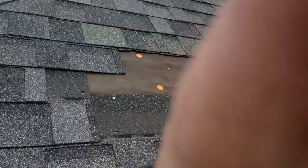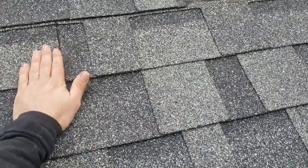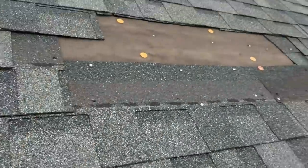If you do need to troubleshoot your roof, you probably just want to start with finding where the leak is. Obviously you know that there's a leak — a yellow spot on the ceiling is going to be a leak that's already dried from a couple days ago, while a wet spot on the ceiling is a current leak. For the most part, nine times out of ten it's going to be a pipe or a chimney — something out in the detail area. Shingles aren't supposed to leak out in the field unless you've got something like nails near seams, which is a really tough leak to find. One of the best ways to find it is to go up in your attic, take a look around — you find wet insulation, water droplets on the underside of the plywood or on the rafters. That'll help you troubleshoot and find out where it is.